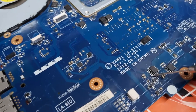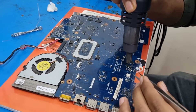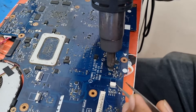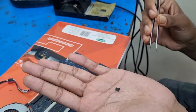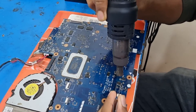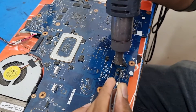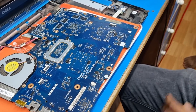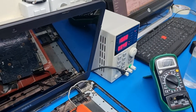Now we'll put another MOSFET there and check for display. This particular MOSFET is bad, so we remove it and install a new working N-channel MOSFET in its place. Connecting the new MOSFET and testing: the current shoots up to 1 ampere and the display is now showing.